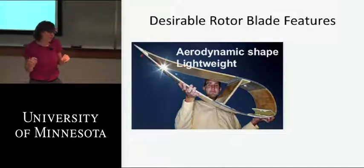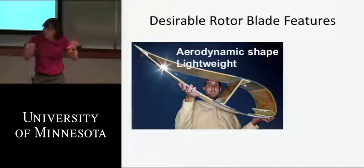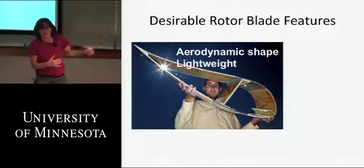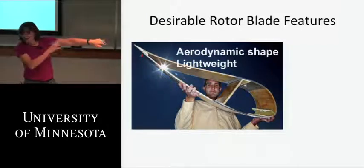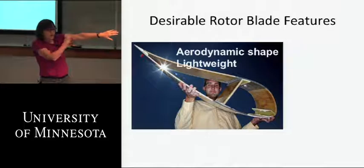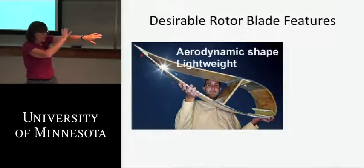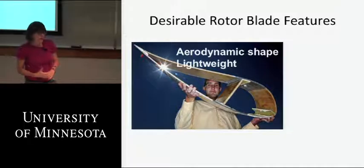And it's all designed so that we've been recently looking at what are all the strains on this. People have spent a lot of time designing this and designing that twist and shape so that the strain is pretty much the same all the way down the blade. So you have one end that has a little bit higher strain, but you don't see these huge variations. So if I took a diving board or a cantilever and supported it at my arm and it was all the exact same size and shape all the way down, then I'd have much higher stresses up here. But they've taken into account that loading and the length and everything else and changed the shape as they move down, so that it's appropriately sized. And again, this is why composite materials, fiber reinforced plastics, are perfect for this, because it's very easy to construct this and have the shape change all the way down.